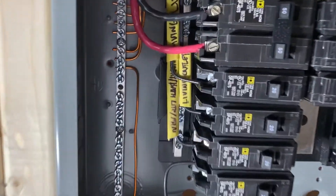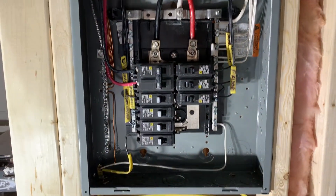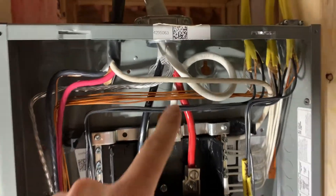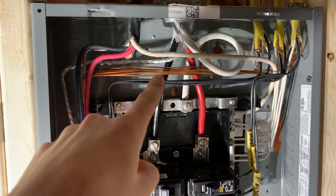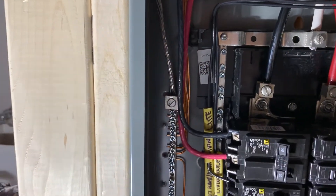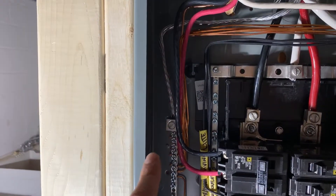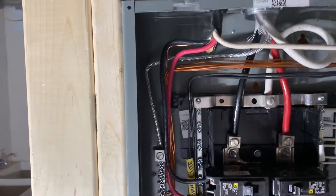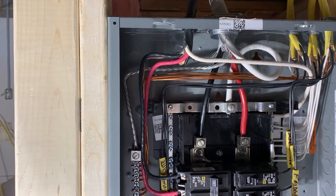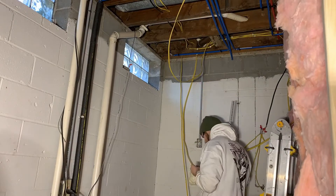I left a little yellow tab explaining what each circuit is — the fridge, the microwave, the bathroom fan, all that. I need to run to the store because the wire coming in is aluminum 2-gauge wire and I had to use a lug for it since it didn't fit the ground bar. I need to pick up another lug for the main panel so I can tie that ground down.